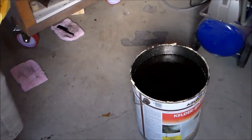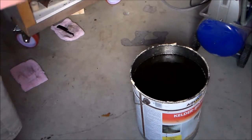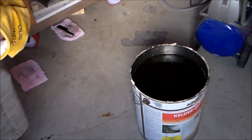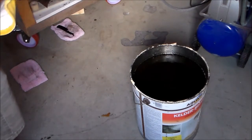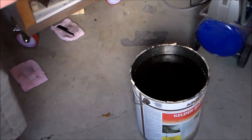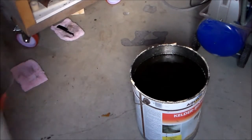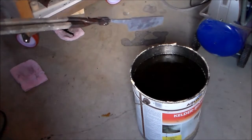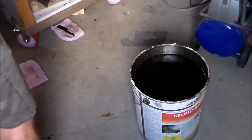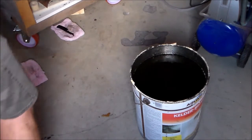If you take the steel out of the oven and you look at the blade surface as it is cooling down, and you see dark blotches, that means that there's a problem in the steel. Then one of the layers doesn't make contact with the other layers and cools down more rapidly. So you can see dark patches if the forge welding was not entirely correct. I hope you saw this. This looks quite good.